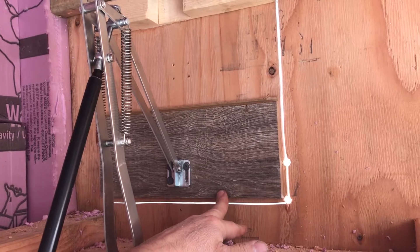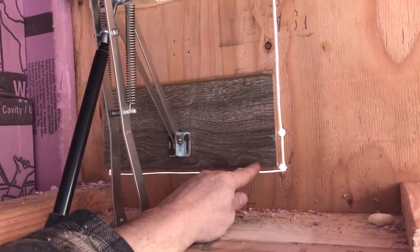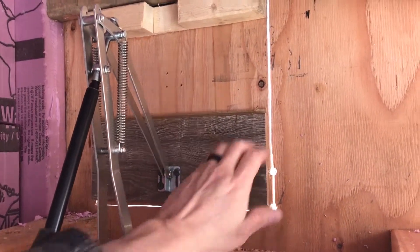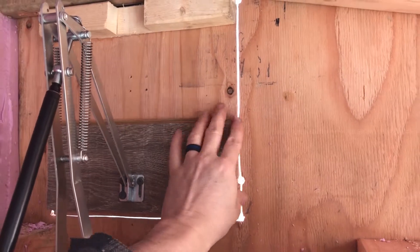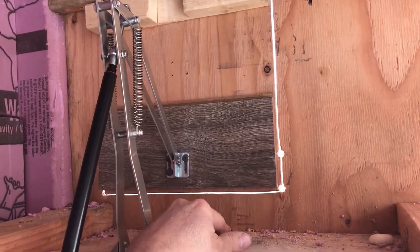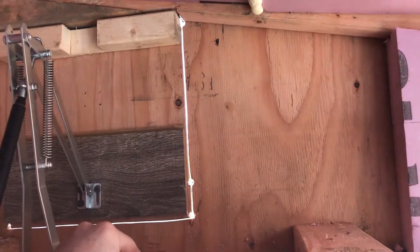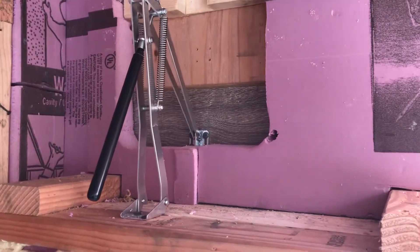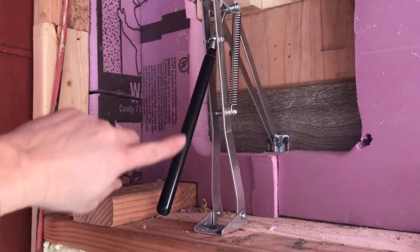I'm not sure how I'm going to test this because it takes heat to activate it, but when it opens up it should expand like that and let the heat out, then as it cools down close back up again. I ended up cutting my opening bigger — you can see where my first cut was — and then I spliced in the piece I cut off to make the opening bigger, which I didn't have to do, but I didn't know it. On the other side I might go the full distance all the way down, which allows that much more heat out quicker. I have some trim to put on the inside to help seal this up so when it closes at night it's weathertight and no air can come in. I'll trim that out and put the insulation back on. All right, here it is completed — it's not pretty, I kind of frankensteined it — but as long as this cylinder works, I think I'm good to go.